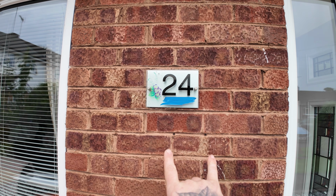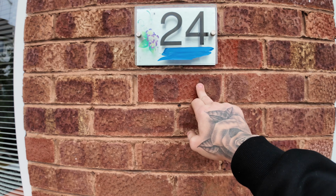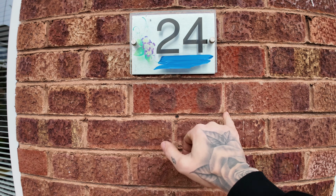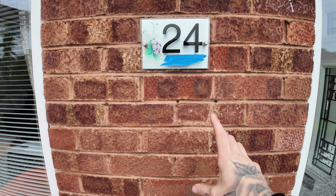Dustpan and brush below. Obviously the mortar is going to be a different colour dust compared to the brick. So I will make sure if I drill a bit of mortar, I collect it, we'll put some silicone in the holes, we'll blow that in, we'll show you that, lovely jubbly, it just makes this a finished wall nicer.